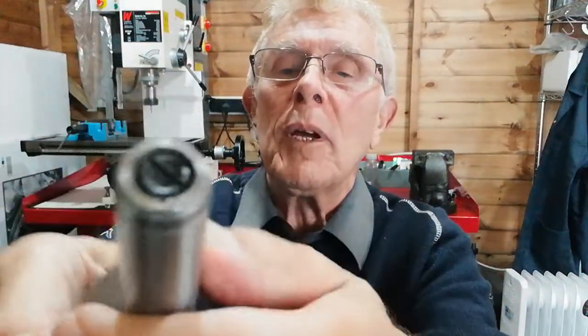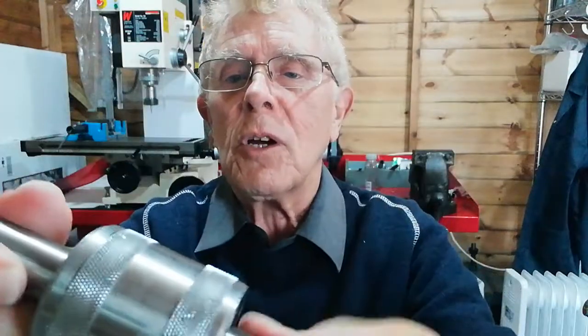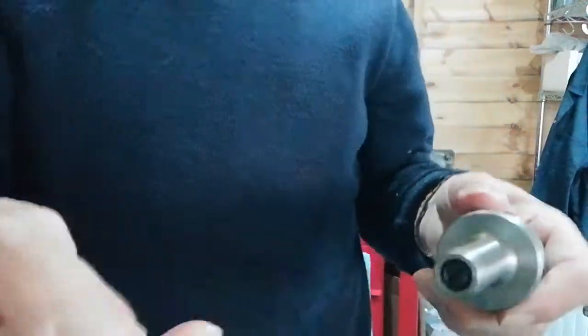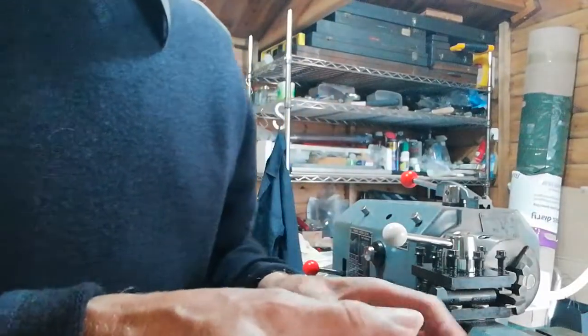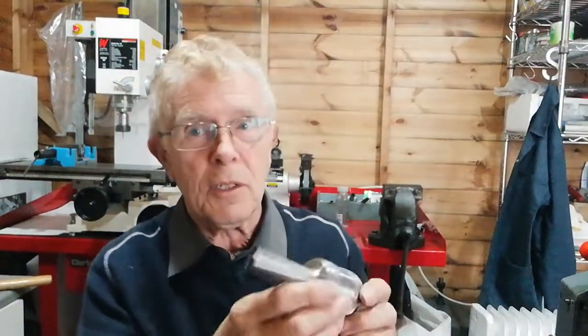I've observed that there's a screw in the bottom of that which we may be able to adjust to allow for it, but I'm reluctant to try because the screw's there for a reason — it may help to position that radius. So I'm reluctant to alter that. With knock-through centres there's also a fine thread on that for some other reason, but it's for Chinese lathes with knock-through facilities on the tailstock, which is not self-ejecting — you put a rod through, tap it, and it's released. Make sure you've got a bed protector on. This is the first time this has ever happened to me in many, many years — and that's the reason.